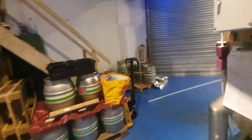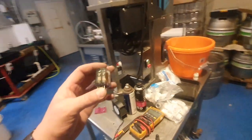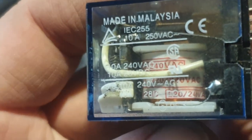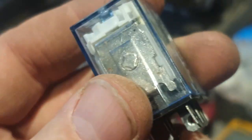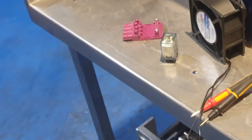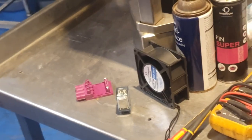The relays that I use in those control boxes — and there is a video on my channel about how to build these if you want to, I think it's called 'Brewery Temperature Controller' or something like that. I'll use these little fellas. So that's the code for them on the side — it's a knock-off Omron LY2NJ. It's a double pole, double throw, 240-volt, 10-amp relay. I cut out the little LED and resistor in there — the indicator that tells you it's on — because the resistors generally aren't rated properly and the LEDs and resistors get really hot. They're alright for switching relatively small loads like maybe a 100-watt pump or something like that. I wouldn't use them to switch an element on a brewery or whatever — it's alright for small stuff.